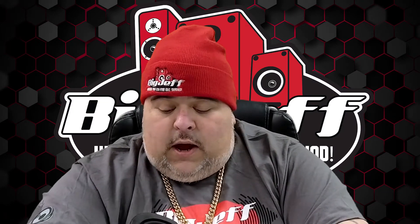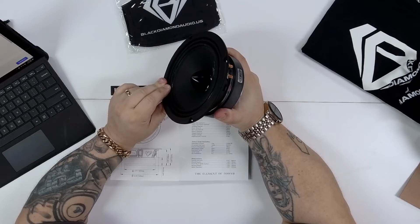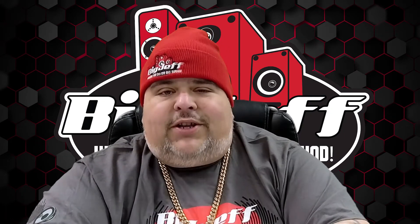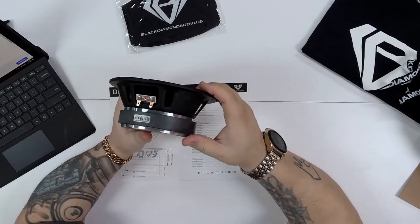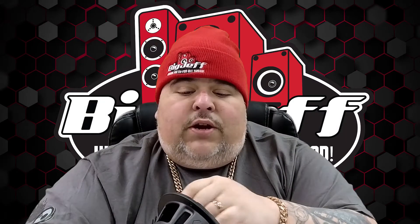It is rated sensitivity at 94 dB. Frequency response is pretty decent — 125 Hz to 12 kHz. 125 Hz is pretty low in the mid-bass range, so I would almost call this a mid-bass/mid-range loudspeaker. They're recommending your high-pass crossover should be set at 140 Hz. This is paper, as we said, and it is a ferrite 30-ounce magnet — a credible speaker, real inexpensive.